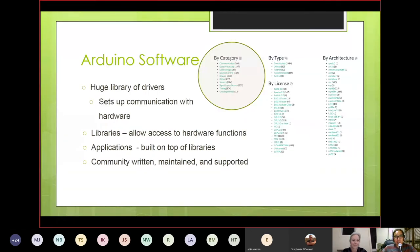One of the huge benefits of Arduino is the library of available software. In embedded development you spend all your time writing software and drivers — adding a new chip is a huge decision because writing a driver can take five months. Writing a FAT32 file system used to take three or four months, whereas today you just use the SD Fat library and it's already there. That's one of the big reasons we think Arduino would be a really good platform for conservation technology.